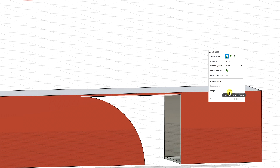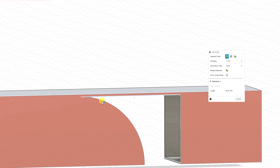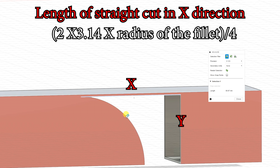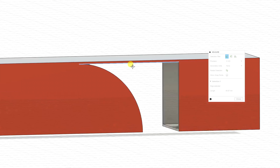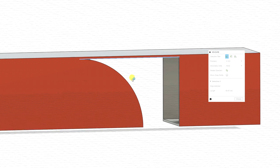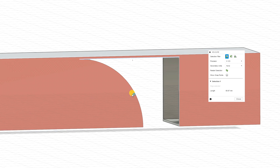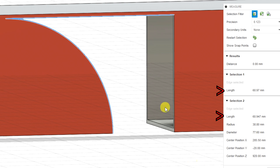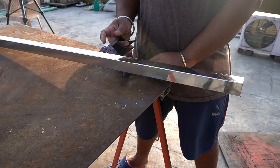The way to calculate the top straight line is by dividing the periphery of the circle by 4, because we are using the quarter portion of the circle to make our 90-degree bend. Once this is rotated after cutting, we achieve that fillet-style joint which looks very beautiful in any kind of build. You can also see that the length of the line is almost equal to the perimeter of that circle, which is 60.9.